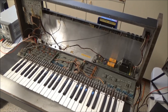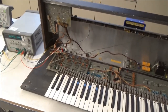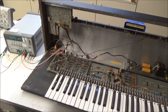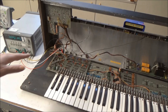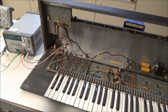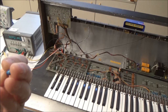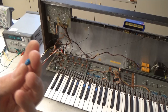And, you know, for the advocates of tantalum capacitors, this is a good supply. I mean, it's an older one, but it's a good one. There are no spikes above 15 volts being put out there. All the tantalum capacitors in the synthesizer, they're rated for at least the 15 volts. Let's see, this one that we took out before that sits on a 15-volt rail, it's got a 35-volt rating.